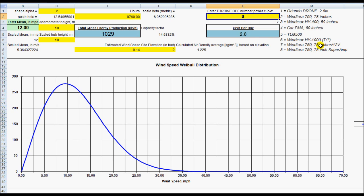Or if I just use the stock 750 on a 12-volt system — which we know it's not really designed for, but you can use it on a 12-volt battery — select that as number 7, and you can see it drops down to 1.9 kilowatt hours per day, or 684 annually. From this I've been able to generate some curves for the Wind Sure that'll be helpful for those people that own one or are looking to buy one.